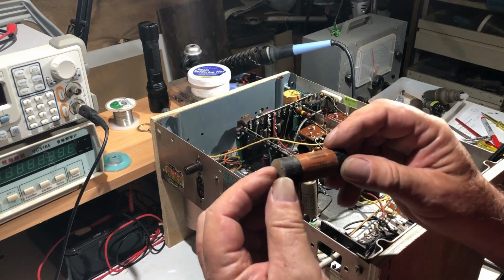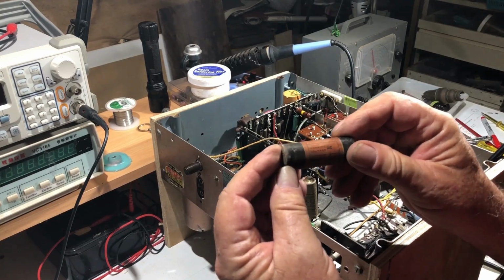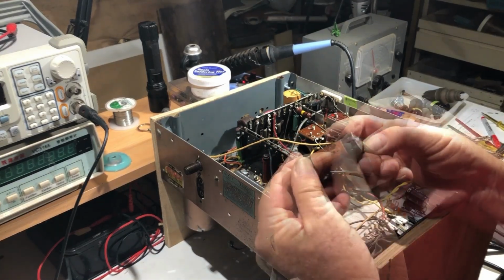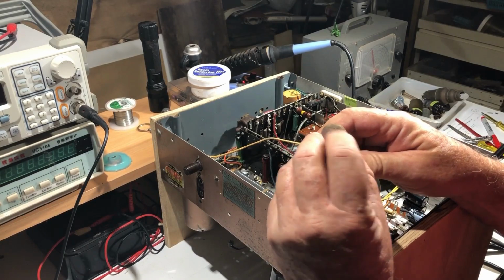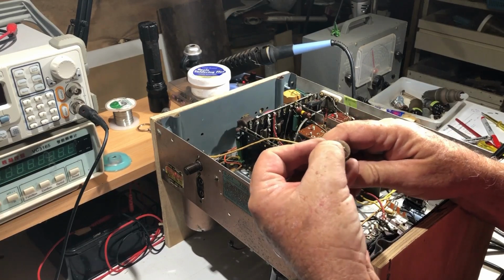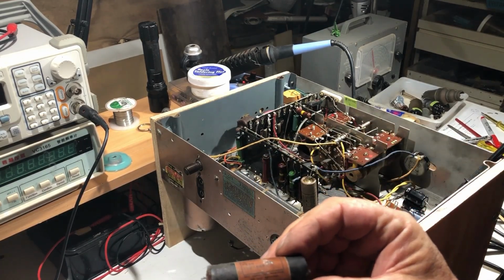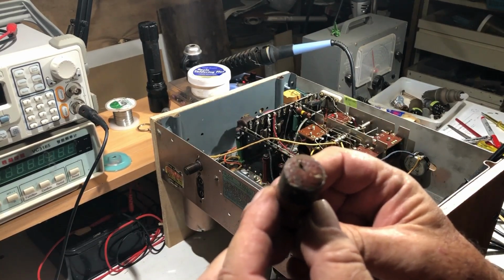Condenser, electrolytic condenser, type 61, 25 microfarad, 25 working volts, and it must say there somewhere which end is positive. This end is red, however, when you scrape the dust off it. And you can work it out from the schematic anyway, but as it does say there, red indicates positive, do not reverse. And this end is indeed red-ish.